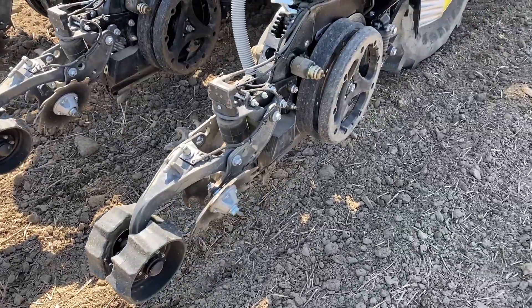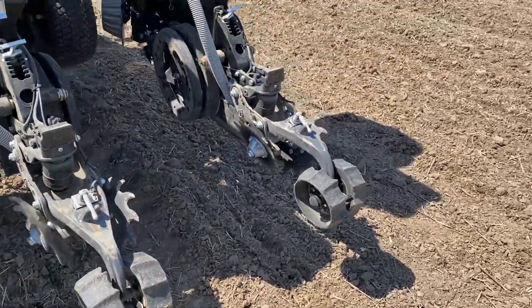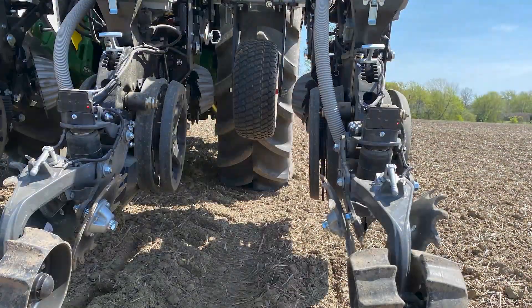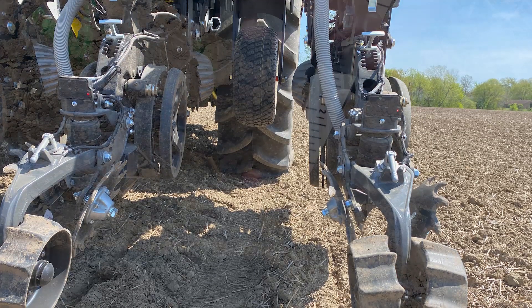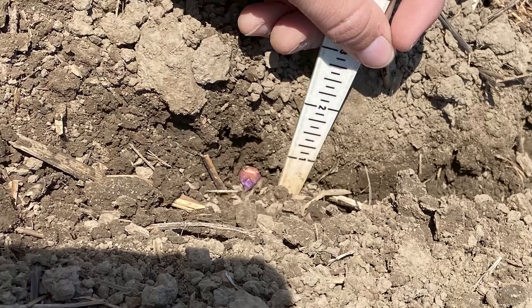This is aero tube on these two units here and you can see the hose coming down feeding air and it's just blowing. We'll use medium flat seed and basically the unit knows exactly how much air is needed to flip the seeds tip down every time. You can see right here we have a seed tip down and right there it's exactly tip face down.